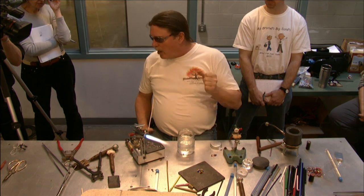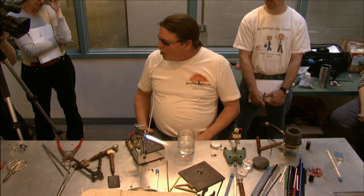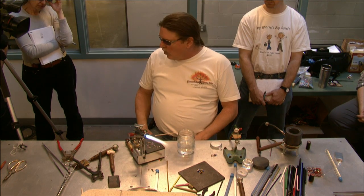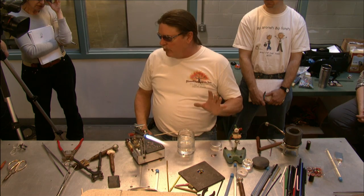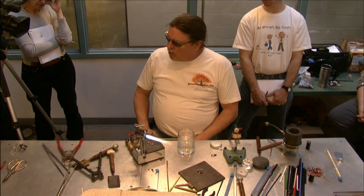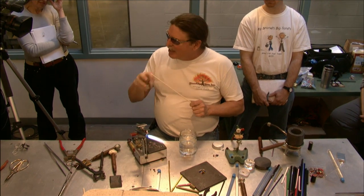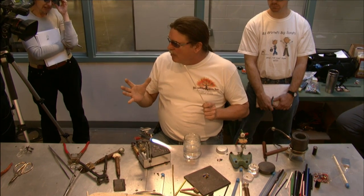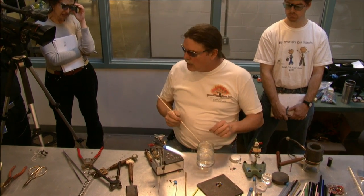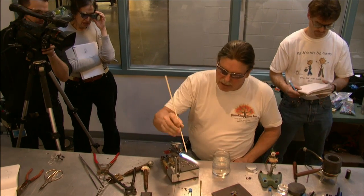Whenever you pulverize or grind, no matter what you do, with a ball mill or a pounder or a garbage disposal or a super shooter, whatever, you're grinding and pulverizing the glass, which is creating a powdered situation and or ground edges. Ground edges are always dirty. Whenever they get hot, they fry up, turn back in, catch a bunch of bubbles and turn into scum, basically. What you want for this kind of thing is a very crisp, clean type of grit. So it's a real easy thing to get really fine grit.